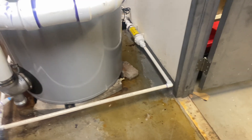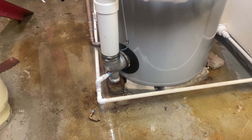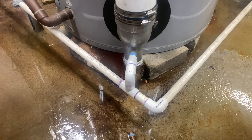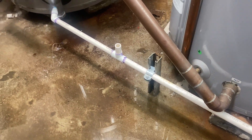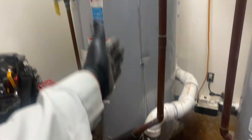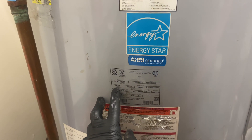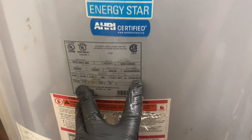I have good pitch here. Coming out of the condensate trap on my right water heater, I threw on that PVC by female adapter, immediately went to a 90 pointing down, then added a T. Let me start from the beginning. We have this A.O. Smith BTH 300-200 — this is a 300,000 BTU gas-fired condensing water heater with a recovery rate of 349 gallons per hour. This bad boy is massive and it's from 2015.